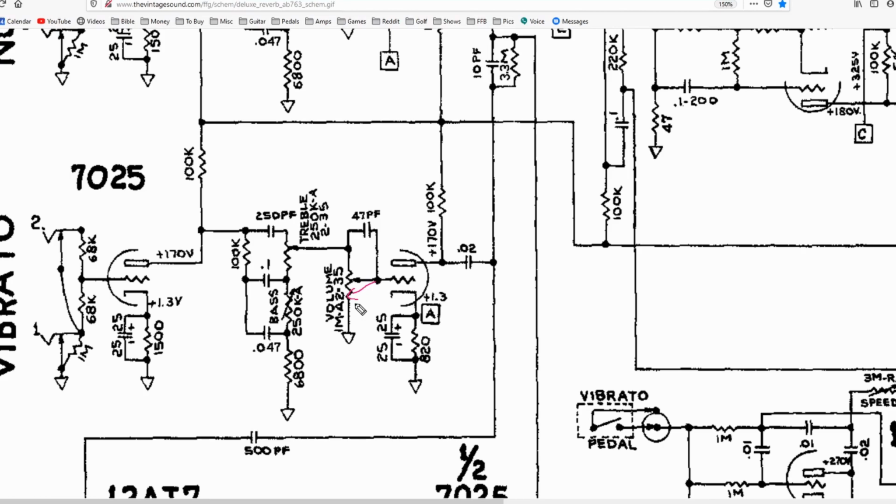And the reality is that overdrive, by its nature, generates higher harmonics. What that means is you've got notes being stacked upon your initial fundamental pitch, and those notes are higher in frequency. So whenever you use an overdrive pedal, you more than likely have quite a bit of treble frequencies in your signal that are being generated from those harmonics. You might have an overdrive pedal that sounds really good and the way you want it to sound. But then all of a sudden, if you switch the bright cap on, that overdrive pedal is really going to be accentuated in those treble frequencies.